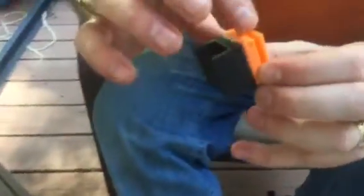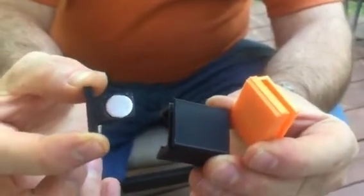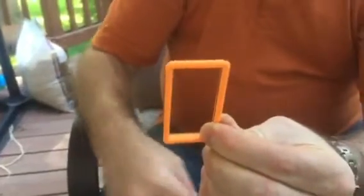I've also got a door handle I'll show you later. To hold the panel on, I came up with these magnetic pieces. The part that's on the 2020 is two magnets deep. They have these little trays, and inside the tray are Neo magnets you can get from Michaels or other craft stores. You just put the magnet in the tray, snap this part onto the 2020, put this onto the foam core or plastic, and now you've got a way to keep it on. I also made some windows — you just cut a hole in the foam core or plastic and slide that in — for where the USB cable or power cable goes in.